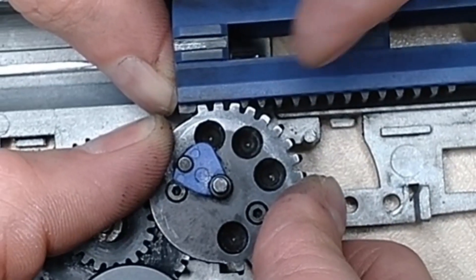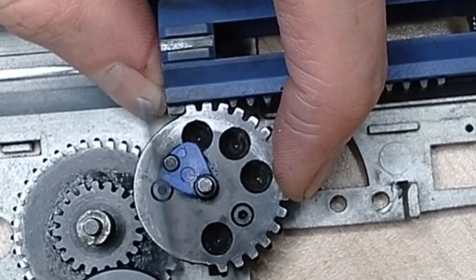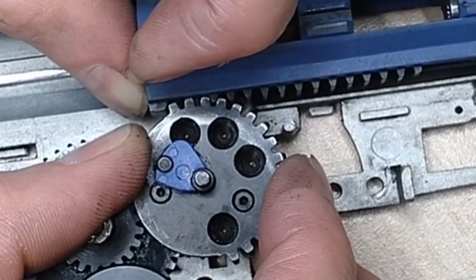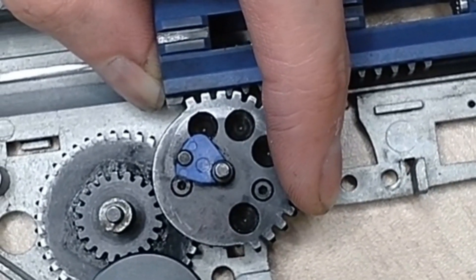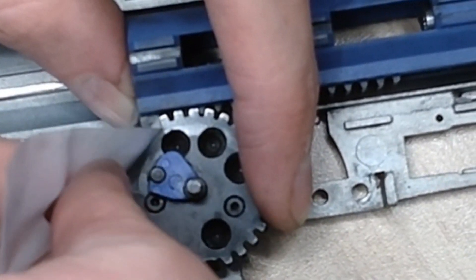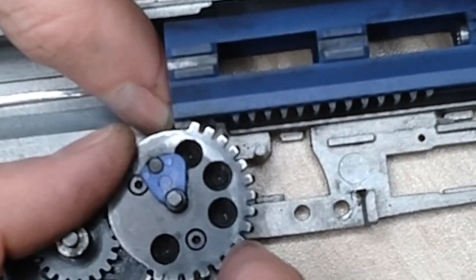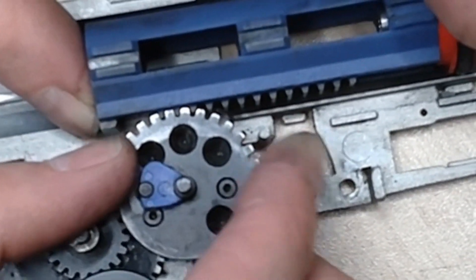Because we haven't got the teeth here to continue the piston coming back evenly, we're still at this point relying on this one tooth. This tooth that's now trying to pick up is not picking up in quite the right place, so we've compressed the spring and it's now fighting to pick up. As it does, it pushes the piston back more than what the gear is actually rotating — by a fraction. Which is why, when I move my fingers, you can see a gap. I can literally slide a bit of packaging material between the two. That gap is there because that poor tooth is now struggling and repositioning itself, pushing the piston back further than the gear's rotation.